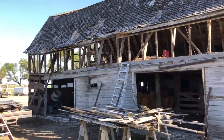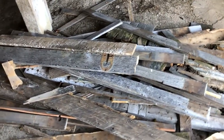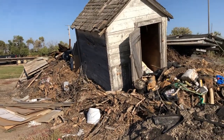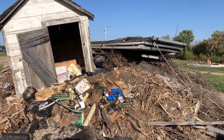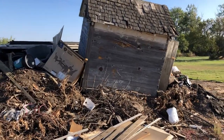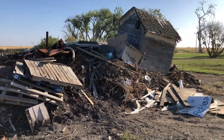Last thing you want are nails everywhere. They're a decent nail, but they'll go through any tire, and of course there's a ton of them. Out of a barn this size, you'll probably get half to maybe three-quarters of a five-gallon pail of nails. According to the agreement you made with the landowner, you're going to want to put the metal with the wood — start making piles in a designated area. All metal goes in that pile, all wood goes in this pile. Pick up as you go along — that's probably my biggest word of advice. Not only does it make things nicer because you have a clean workspace, but you also reduce hazards: those nails aren't sticking out waiting to be stepped on. If you keep yourself a little organized, it'll make things go way smoother.